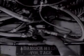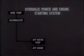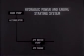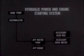The APP motor pump is a dual-function device. It serves as a motor to start the APP. Then, after the APP is operating, it serves as a pump to provide hydraulic pressure. Therefore, the APP motor pump drives the APP engine to start it, then is driven by the APP to serve as a hydraulic pump. With the APP started, pressure flows to an accessory drive motor. This motor, in turn, drives the accessory gearbox. With the accessory drive motor operating, the accessory gearbox and all of the Chinook's hydraulic and electrical systems can be operated without starting the main engines.